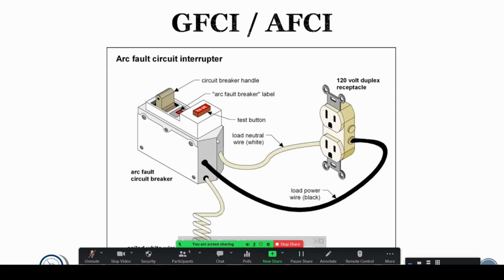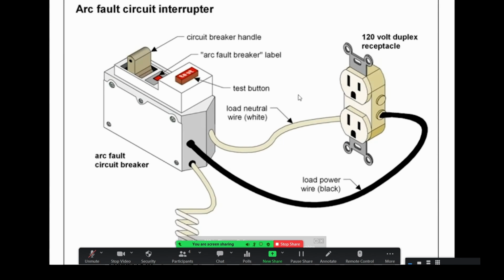Because it's very important whenever you're wiring up anything to make sure that it's properly grounded, properly bonded throughout the structure, but also keep in mind that in some cases when you're dealing, especially with convenience outlets, anything where there's potential moisture involved, ground fault circuit interrupter, GFCI, is important because, like we mentioned, you could potentially be a ground path and not draw enough amperage to trip a breaker. And so a GFCI basically looks for imbalance between neutral and the hot. Again, this is for 120 volt circuits primarily. Convenience outlets is where you're going to see this more than anything else. But it's important to understand what they do and why they matter.